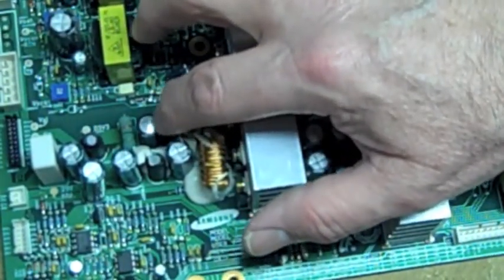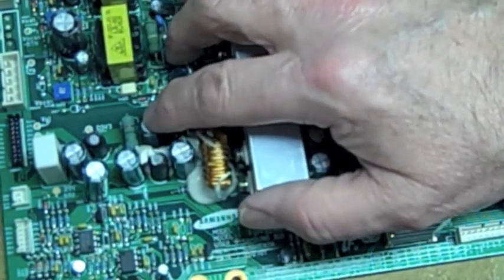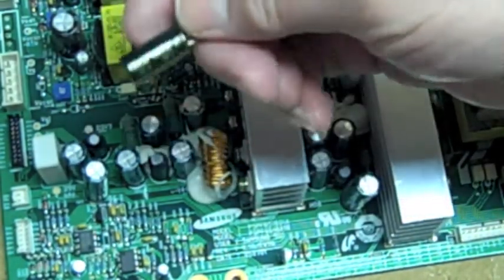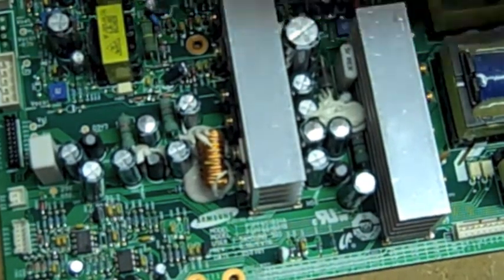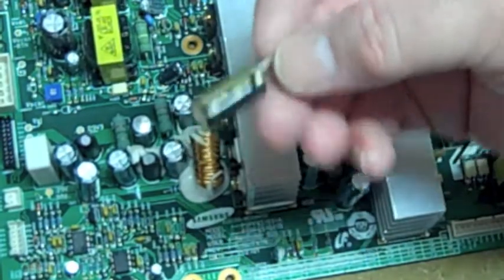and we don't feel like waiting until tomorrow to go to Radio Shack, because we're going to hook 2000s in series. We have 2000 UF capacitors at 16, so that'll give us about a 500 UF if you hook capacitors in series, just like resistors in parallel.